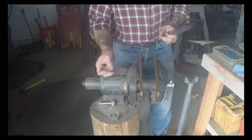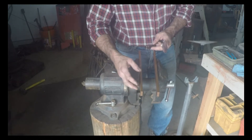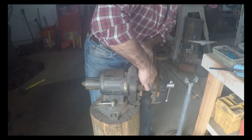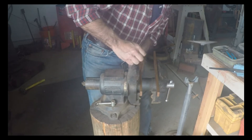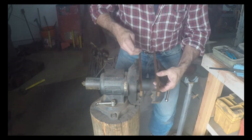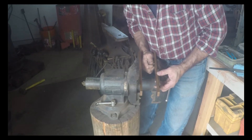I've got some thin shim stock — I worked on this one last night. This thin shim stock is about 0.01 inch, and I found out that if I put two of these behind this spot here on each of these jaws, I can get a nice match on my distal taper when I bring my jaws together. So I'm going to just tighten my jaws down a little bit with my shim material behind there, and we'll be ready to go into the tightening up on the dagger.